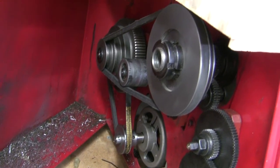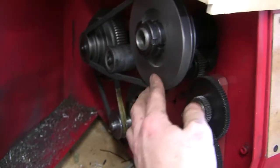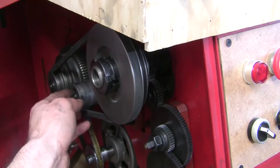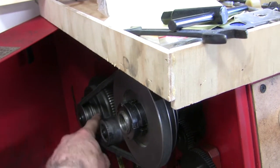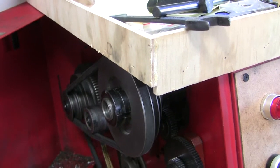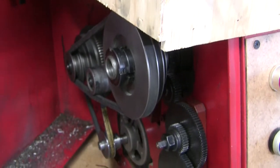I've got the pulley, and I'm actually getting a longer belt because this idler basically does nothing. I want to be able to release the tension from the belt, because whenever I want to turn the chuck I have to turn the whole drivetrain. I want the idler to actually put tension on the belt. I've got two speeds — at the moment it's on the slower speed and the maximum RPM on that is about 810. The high speed max is about 1200 RPM. If I need more speed I can move the pulley over, but I don't think I'll often need to go much faster than 1200.